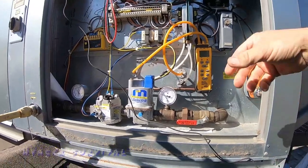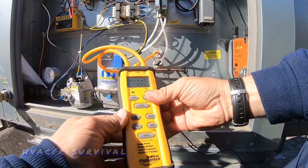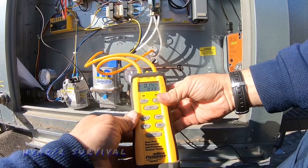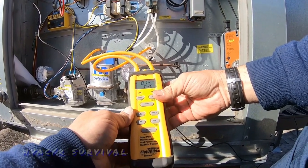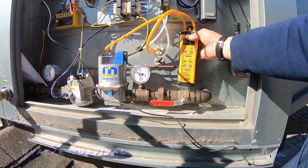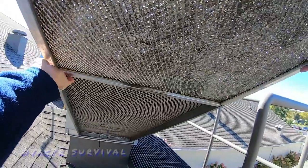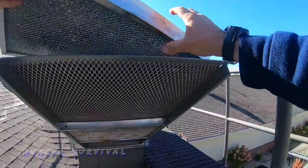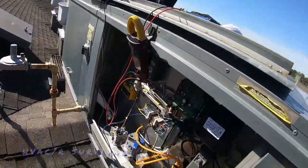Down there it has a maximum air setting and a savings setting. On maximum air the speed has increased a little — we're at 0.34 to 0.4 differential; the maximum it can go up to is 0.8, and that's without the filters. Honestly, I believe this is going to boil down to just plain maintenance: clean filters, tight belts, and good pulley alignment.